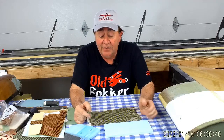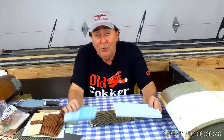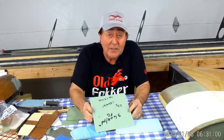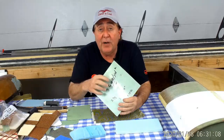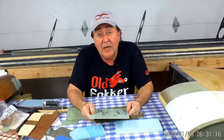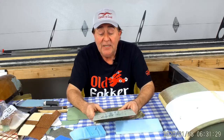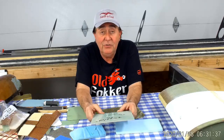The core materials are a big driver — this foam weighs nothing, it's feather light, but if you have 260 square feet of it in your wing skins it starts to add up. One of the big weight drivers is literally the wing skins. When I started this design I thought the entire wing would be molded sandwich panel construction — composite skin on one side, foam in the middle, composite on the other — and I'd have a super slick high-performance wing. But as I built and tested samples, I discovered that's a tough nut to crack because even minimizing resin, I could not get the weights into an acceptable range.